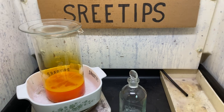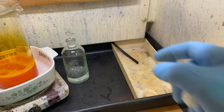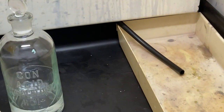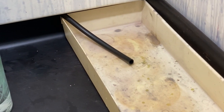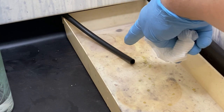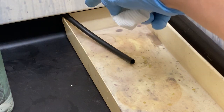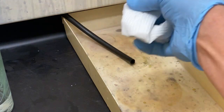One other thing I'd like to look at over here — if you look down here, I've got a small drain tube, and this thing is connected to the ducting for the exhaust of my fan. What happens if any rain comes down the stack, it collects in a little plenum up where the fan is. This tube right here is connected to a fitting up there — it's just pressed on there — and any moisture that makes it down the stack will come down this tube and collect in this little pan.